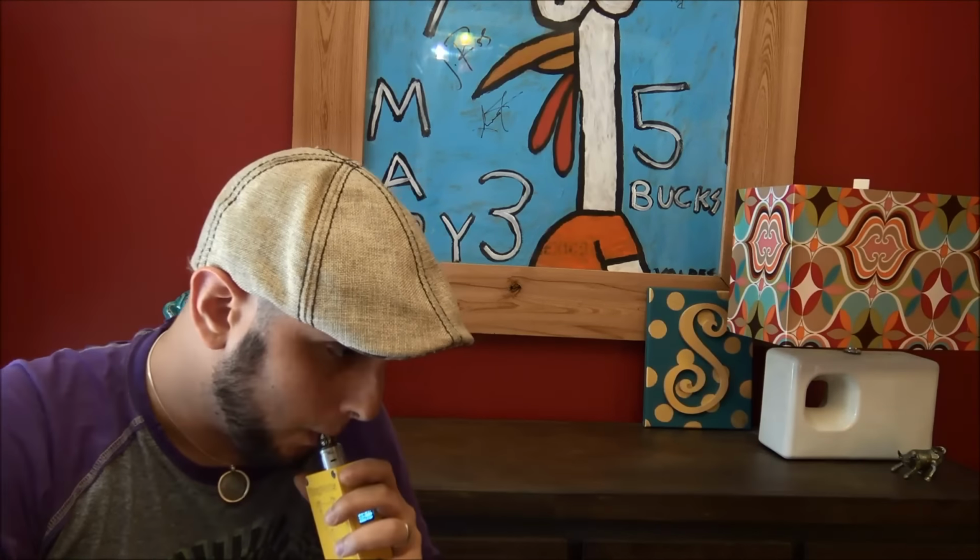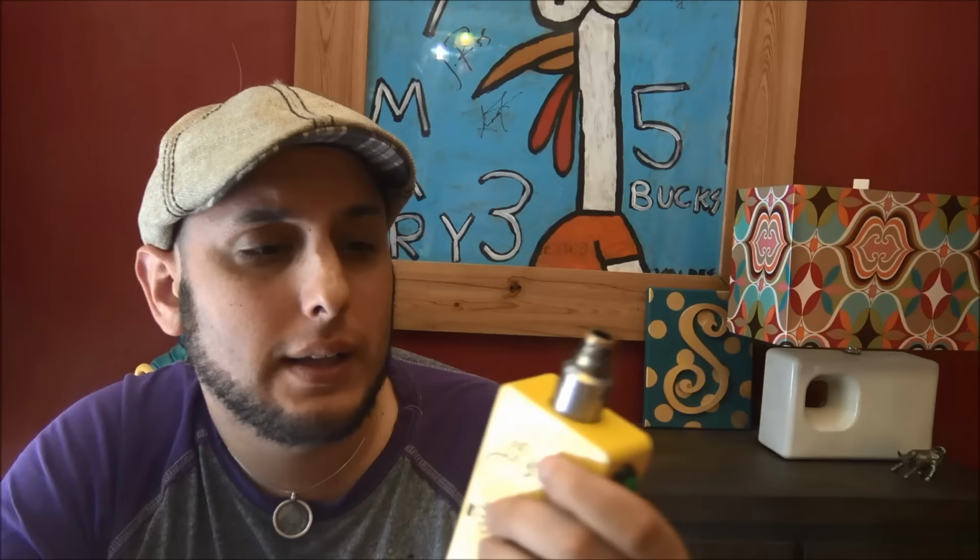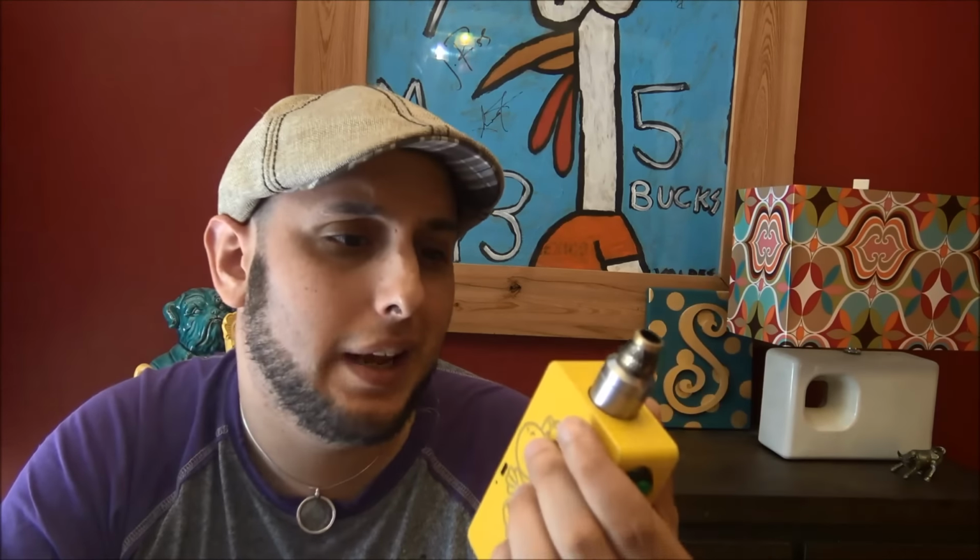Alright, so this is another way I've seen people build the Cascata, with just a single horizontal coil. Kind of like people used to build the Veritas when they didn't feel like going through the trouble of doing the dual vertical coil. It's not enough heat for me. It's at 20 watts, it ohms out to 0.8 ohms, and it's a 4.2 volt coil. So it's basically 4.24, so it's hitting it harder than it would on a mech with a freshly charged 18650. It's not enough heat for me, the way I like to vape.